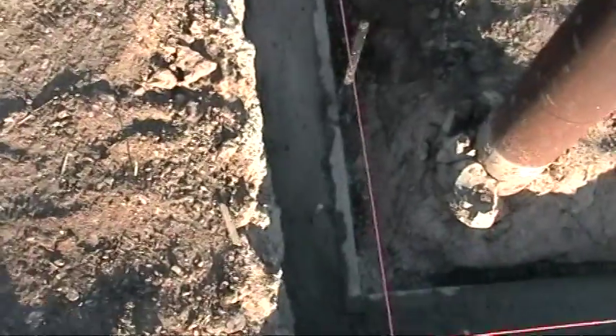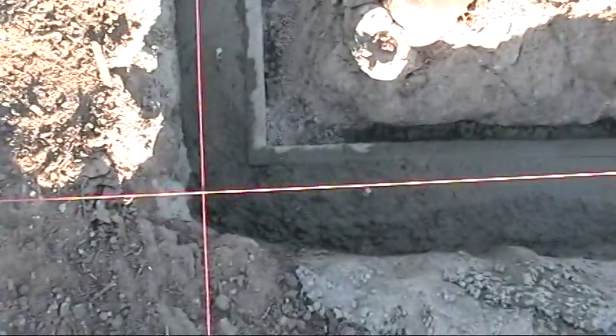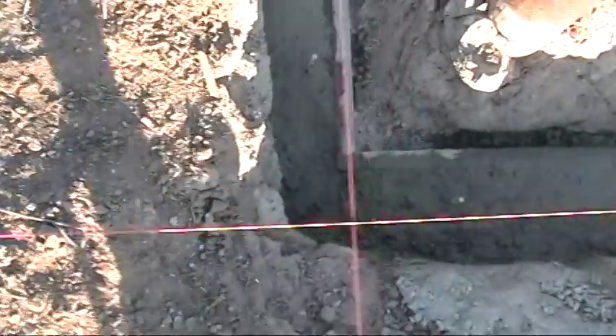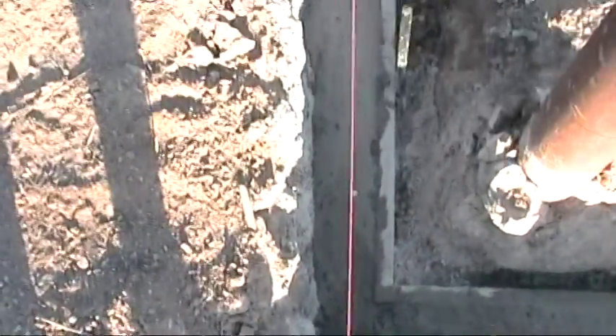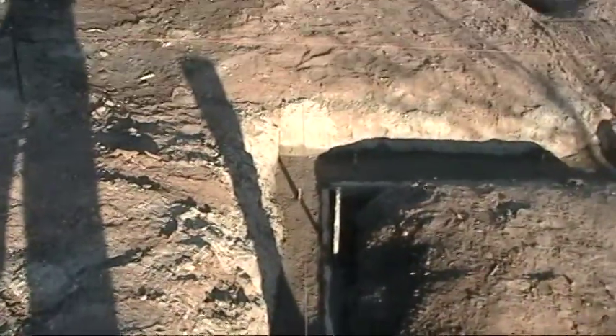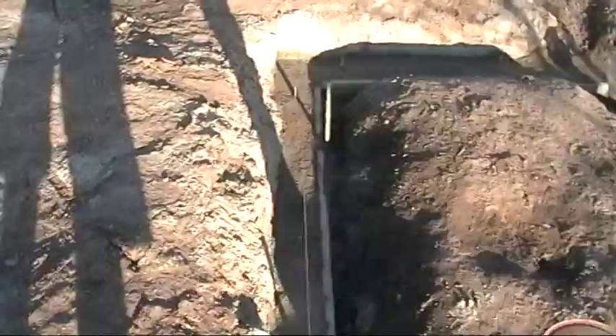This can be constructed out of panels just set down in simple footings right here with rebar coming up. Here you can see where it's been squared with a string line. This footing has been poured as a rough slab down in there. It's a very small structure that's actually going to be used as a pump house or a water pump house out in the desert.